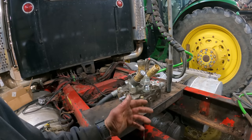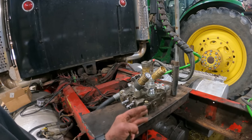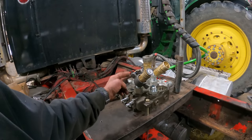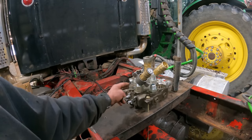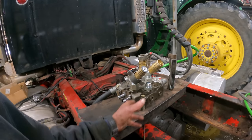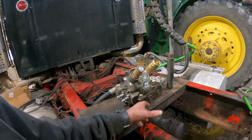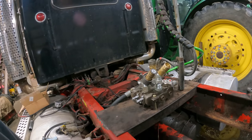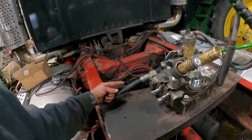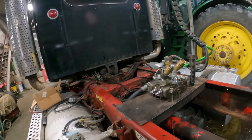The other trucks, the ones that we want to run manure with, or a silage truck, we usually run three on a silage truck that has the rails on there so that we can run the winch off of the other valve. Now I've plumbed them the same with Power Beyond outlet covers, and you get into a lot of screwing around with T's and extra fittings and hoses, and it's going to look a lot neater just having the one pressure line coming in on the front side and a return coming out the back.